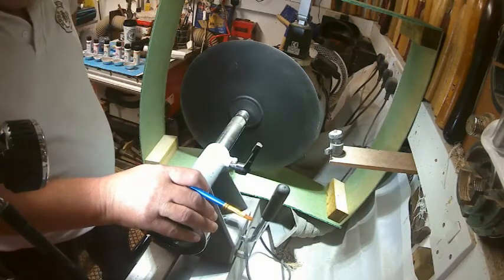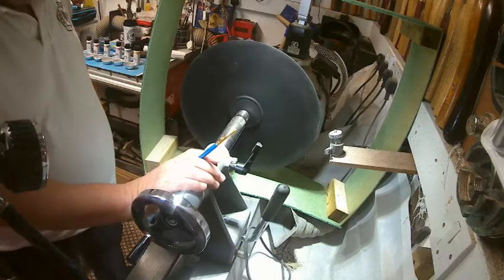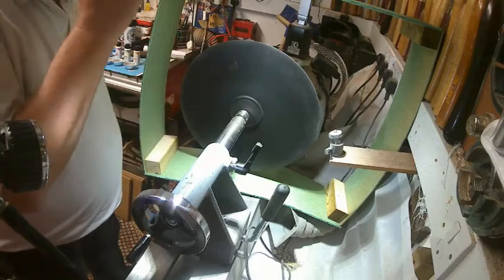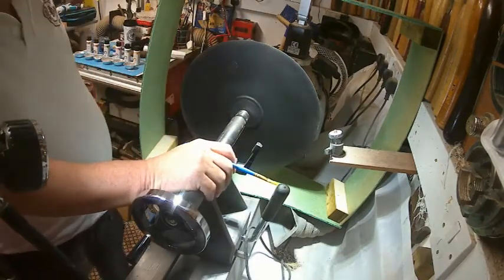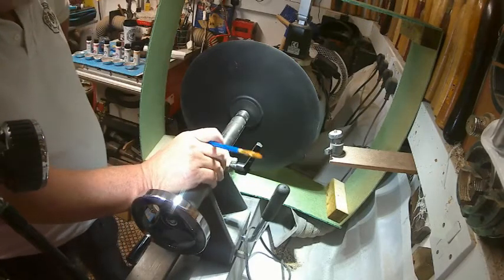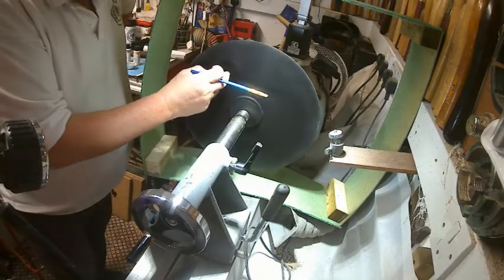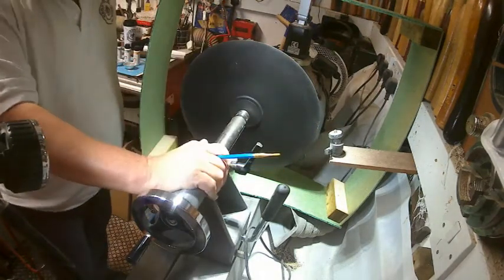Hello — this is the following day. As you can see, I've got my tailstock up, quill fully extended, for support. And this is on a three to four millimetre mortise. To get the effect I want, I'm going to be spinning the lathe at 2000 RPM, and I don't fancy this flying off. So this is why I've got the tailstock support, and it is quite firm.